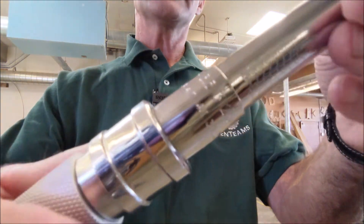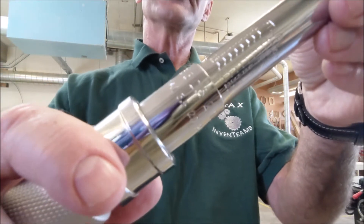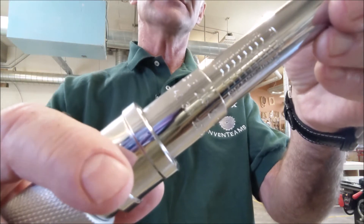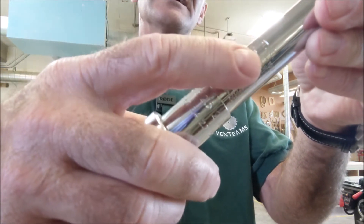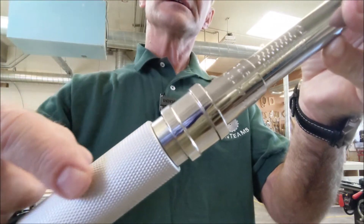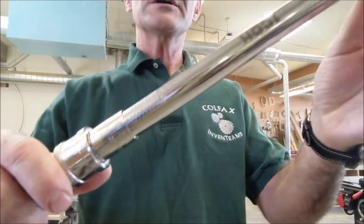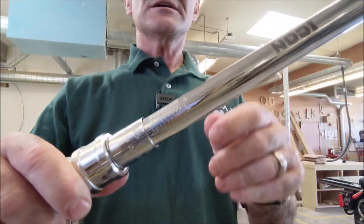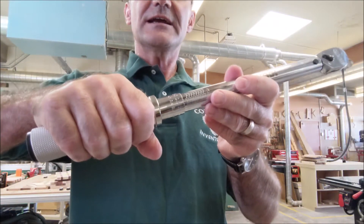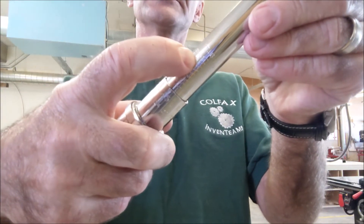On the front there are two different settings — foot pounds on the front and Newton meters on the back. Torque is a measurement of both force and distance, and that distance is the radius from the center. In the US, the standard unit is foot pounds. Pounds is how much force you're putting down on the handle, and feet is how far away you are from the radius — the distance from the socket to the center of your hand on the handle where the force is being exerted.